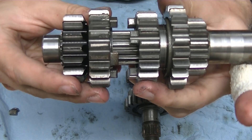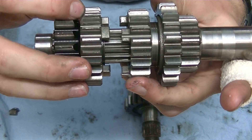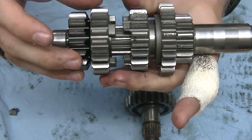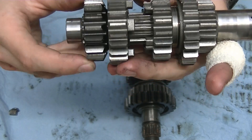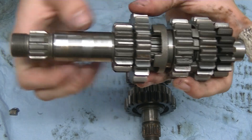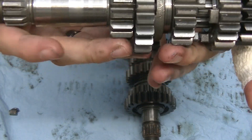We move on to this next gear here, which you can see has some damage marks there and here and along these teeth as well. This gear will also need to be replaced, and I'll put that price right here. Then we have this last gear, which actually looks to be in pretty good shape — I'm not seeing any kind of big damages there. And then this gear, if this one is broken you'd have to replace this entire shaft — it's got a little kink right there, but other than that it looks good, so I'm going to give it a pass.